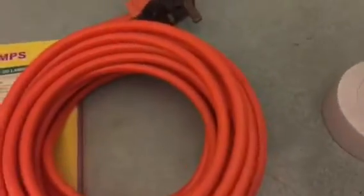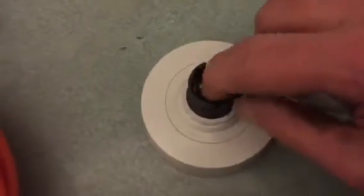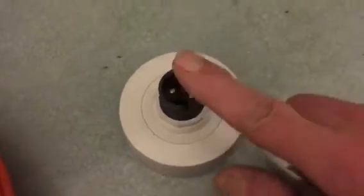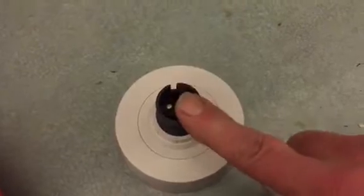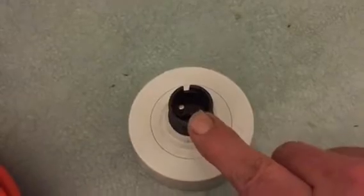This is the ceiling rose here. This fitting is going to the ceiling that way up. When you take your bulb out, your bulb sits inside this fitting and it hangs down from the ceiling. It may be on a pendant fitting, but for ease I'll show you on this. The sprung contacts — those two contacts in there — they are live even if your light switch is turned off, depending on what sort of circuitry your light system is working on.